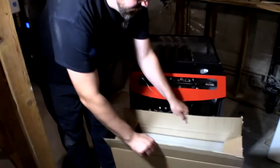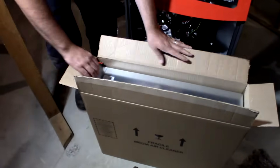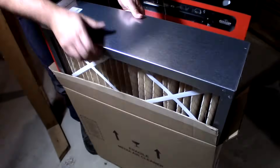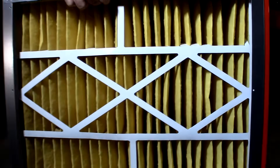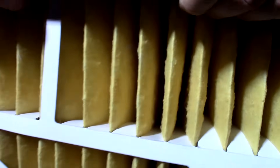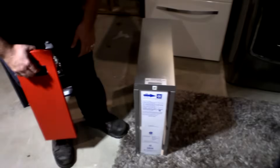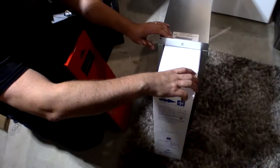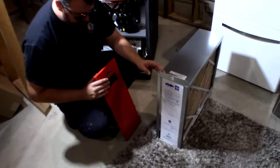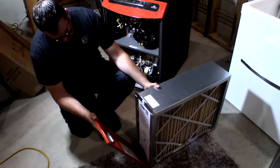Here's the Napoleon filter rack that we're putting in with this furnace. There are specialty Merv 11 filters — it's a 5-inch wide filter, 20 by 20 by 5 — and it just matches the red paint on the furnace. It's easy to open and easy to change. The filter just slides out the front. With these larger filters you typically only have to change them every six months, depending on how many pets and people are living in your house.